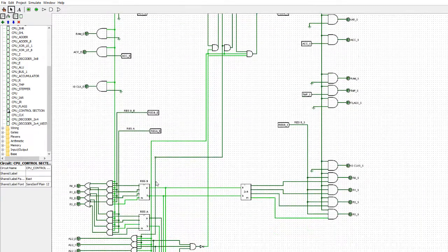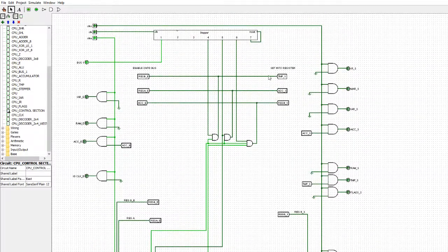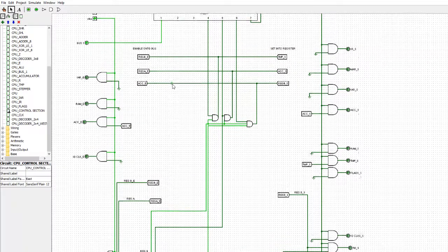Okay, so what it's saying is we should go to the register R3, enable it, so put the value of the register R3 onto the bus. And when you've put it onto the bus, whenever the clock set comes in, we'll set that value in the temp register. So let's just work through these and you'll see this happening.